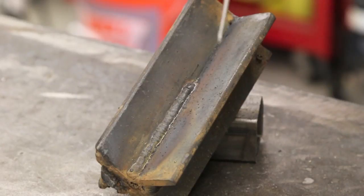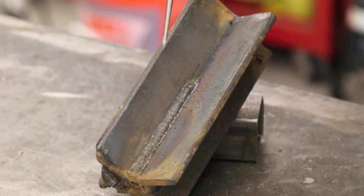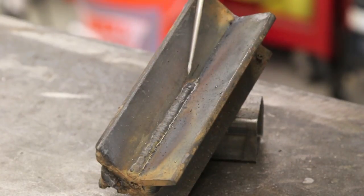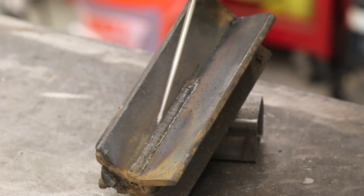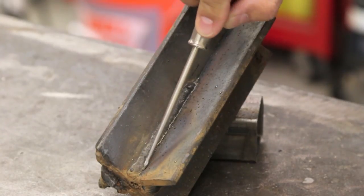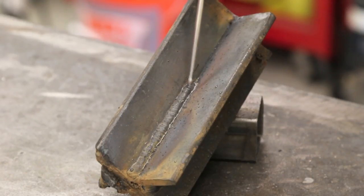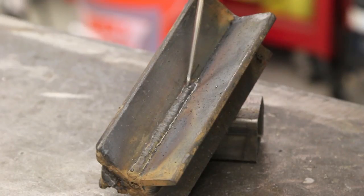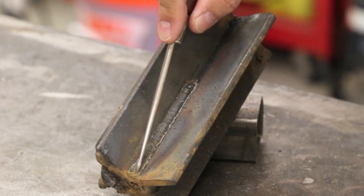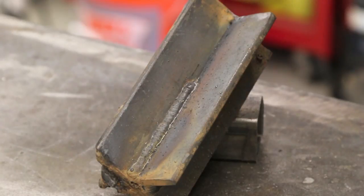I want to begin here with a cruciform that already has a bead on it. I want to show you what we would call cold lap. This is a bead that was welded that really did not go in well because the amperage was set way too low. You can see it humps up really high — it's built up on top and tucks in under itself, almost like a worm sitting right on top of the plate. That's definitely a lack of fusion and lack of penetration. The sides just aren't fusing in to the side wall like you'd hope.